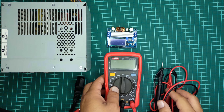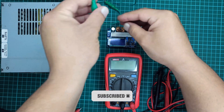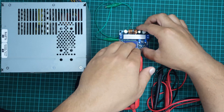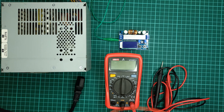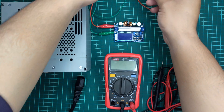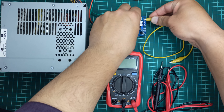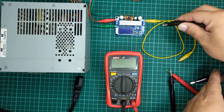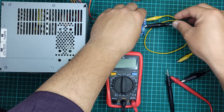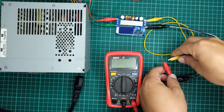I will use this multimeter to monitor the output voltage while calibrating it. I will be using connecting wires with crocodile connectors to connect the computer power supply to the input of this module. Let's connect another set of crocodile cables between the output of this module and the multimeter so we can easily monitor its output voltage while calibrating the module with its potentiometer.